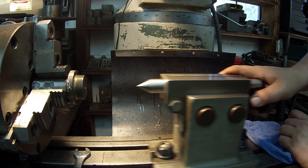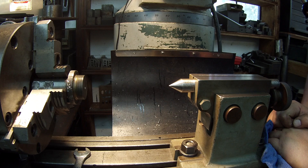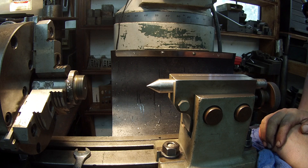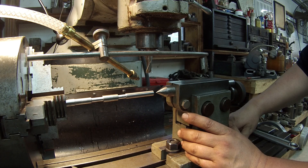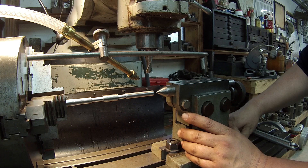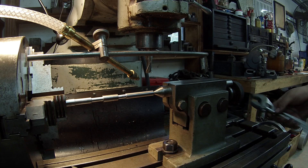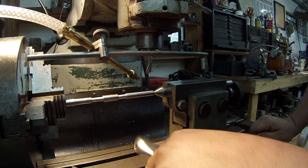It will work for what I'm doing — you're just holding the center of a part while you do some milling, and it will work fine. We've always done it that way. If you're doing really precision work, then yes, you need to make sure everything is on center and square and in line with each other. But for simple little jobs like this, it's really nice. That comes up and seats in that center good and I know I'm very close. I think we're ready to start doing some milling. We hit our height pretty good on this center.